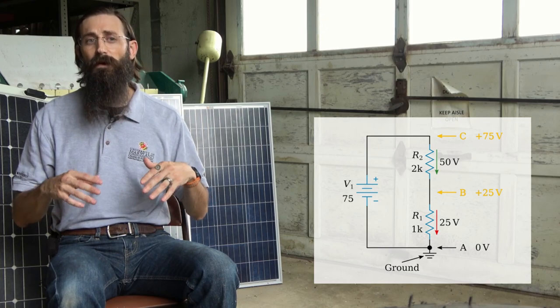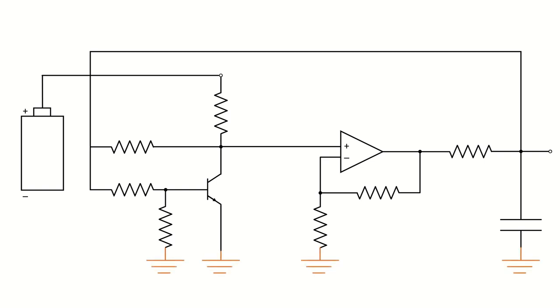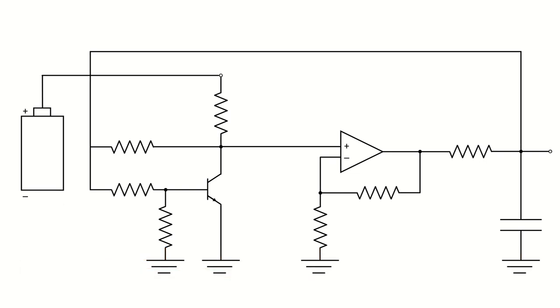Voltage is always relative to some other point of reference within the circuit. In this simple circuit, we have four common ground points that may or may not actually be connected to earth ground or to a vehicle chassis if it was a mobile system. The common ground points in either case, be it the earth ground or a vehicle chassis, will allow electrical current to flow back to its power source, whether it be the utility transformer, a vehicle battery, or something else. While these ground points would ideally be wired with the return paths connected back to the power supply at a single point, that's not always practical, so in many applications a grounding system will provide a circuit return path, with many circuit diagrams simply using the ground symbol to identify a common return path.